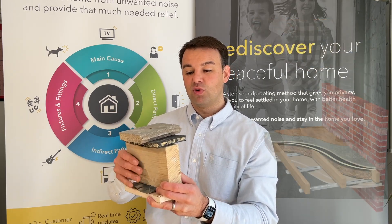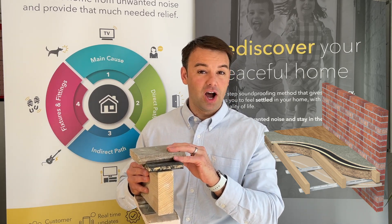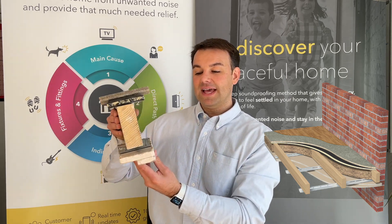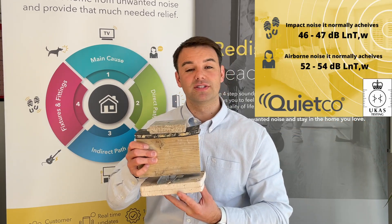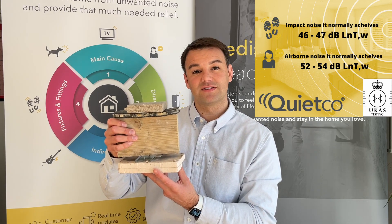It's a direct-to-joist board with only 40mm in space loss. To this you can fit carpet, you can fix a hardwood floor — it's quite versatile. That is the separating floor system. You can use it in HMOs, in separating floors between flats, and to reduce room-to-room transfer.